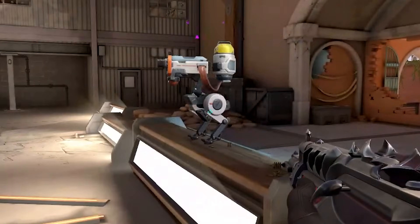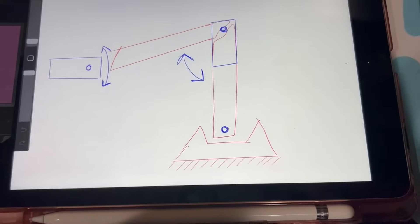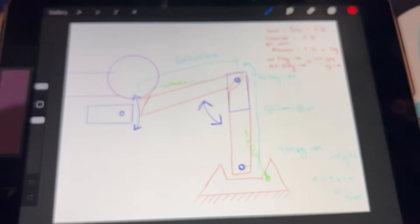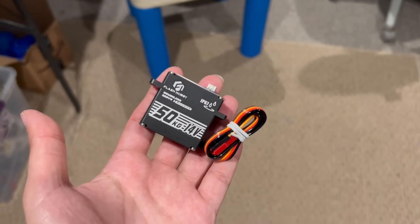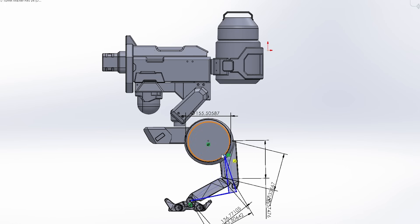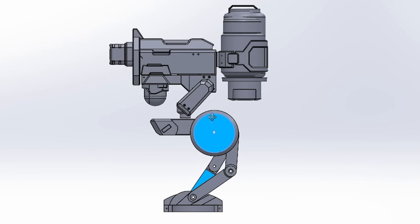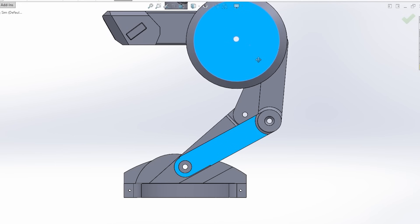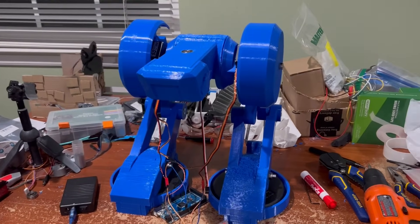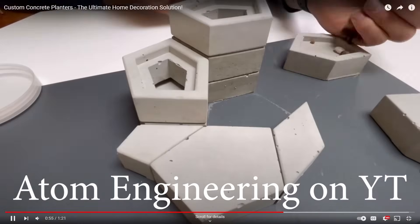When Timmy sees someone, he pops up and a third leg comes down. We need two legs that can move up and down. The common way robot dogs provide lift is with motors in the hip and in the knee, but even with big motors we won't have enough torque to lift the approximate 10-pound load of the upper body. Since all the legs have to do is provide a couple inches of vertical lift, I wanted to use only one motor in each leg. This design hides a motor in the hip and uses a 4-to-1 gear train for increased torque. The hip is attached to a 4-bar linkage mechanism, and as the hip rotates it drives the whole mechanism up. Since the turret is top-heavy, I'm grounding the feet with 5-pound weights.